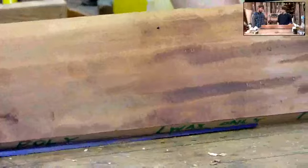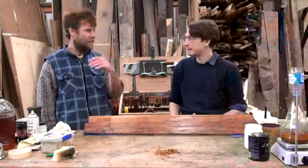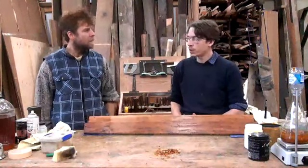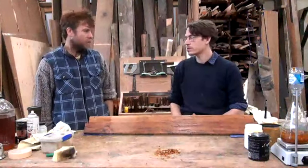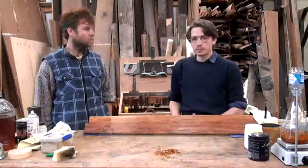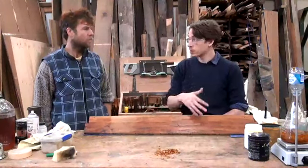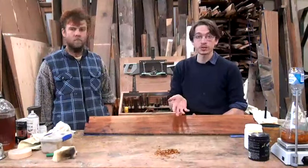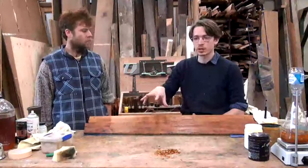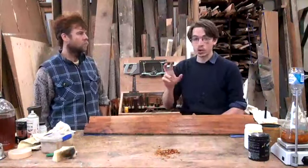Varnish, you go into Bunnings or similar type shops, and varnishes are everywhere, particularly on the home decking. Varnish refers to a polyurethane, would you say? Often, if you're buying a varnish at a store, it's probably a polyurethane mixed with linseed oil or another type of drying oil. So you've got that oil soaking in, and you've also got a resin that sits on the surface. So that's what most of your varnishes will be.